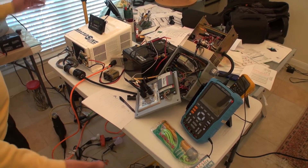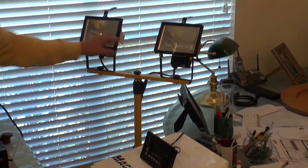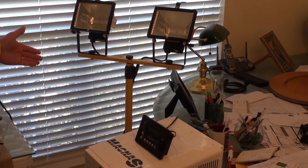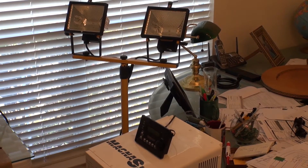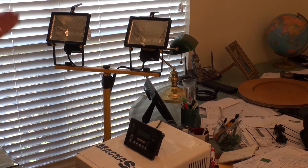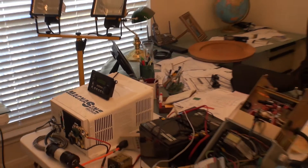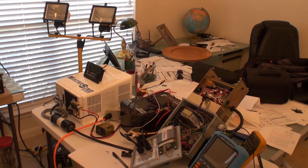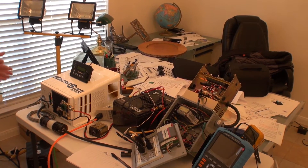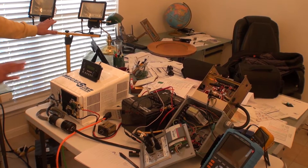The resistive load in this scenario is going to be light bulbs. I bought these work lights — each one is 500 watts, so together they're 1000 watts. I bought them from Home Depot and Harbor Freight, about 40 bucks each. I changed the light bulbs to 240-volt; they used to be 120-volt but still 500 watts each. I'm using 240 volts because I want to dump the load generated by the microinverter directly — the microinverter generates 240 volts. I don't need to step down to 120 or use a transformer. Just directly dump it when I don't need it.